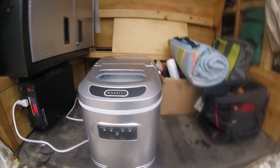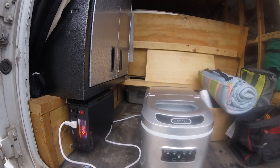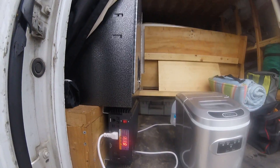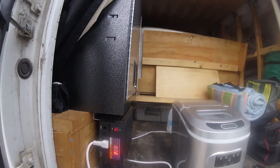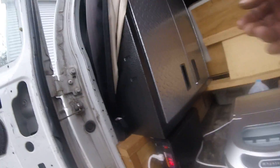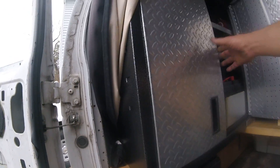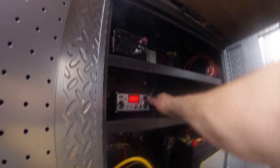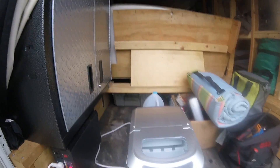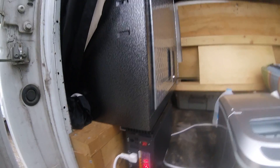It will run back down — I'm gonna make large, so it may not take very long. I heard a chirp but I think it was a bird, not the inverter. It's a cloudy day and I don't know if it may not run off the inverter. Let's see what kind of battery power we got here — we still got 13 volts. That's a pure sine wave inverter, it should be okay. Now showing 11.9, 11.8 — it's pulling a little juice.